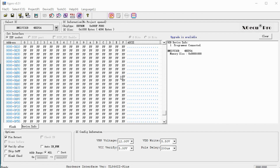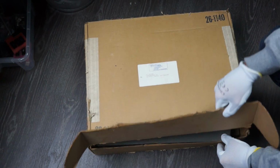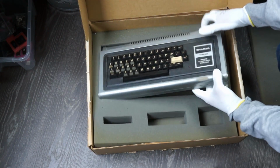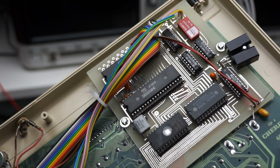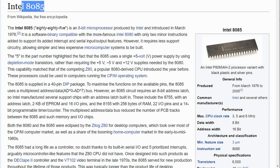Now we already arrived in the middle of the story, which started around 1978 when I got my first personal computer, a TRS-80 with a Z80 processor, running BASIC. After learning BASIC, I started using assembler on the TRS-80 and later built my own hardware. The Z80 was a fine CPU, but too complicated for single-board computers. The 8085, on the other hand, was able to run most of the Z80 commands, and it was part of a system of peripheral chips, which reduced the complexity of boards considerably. Precisely what I was looking for.